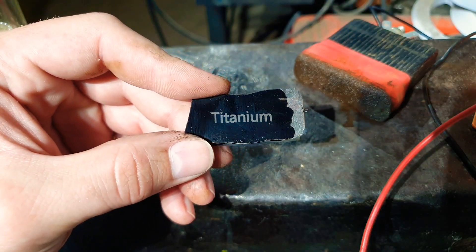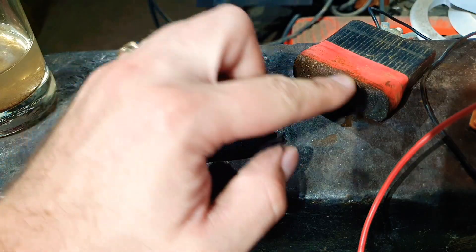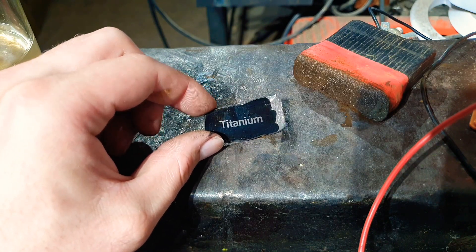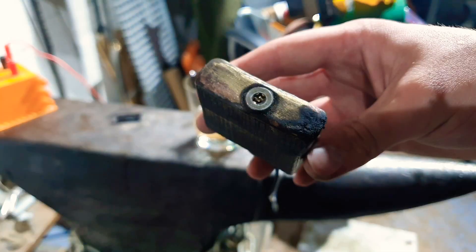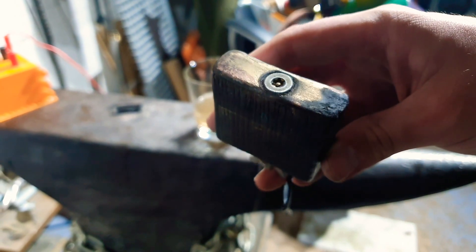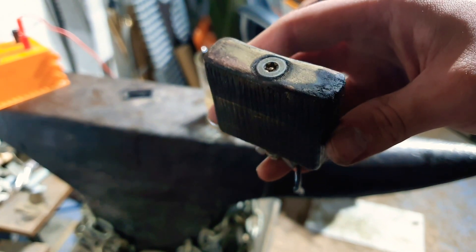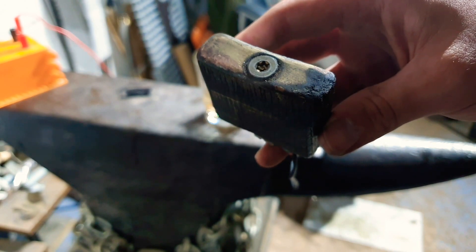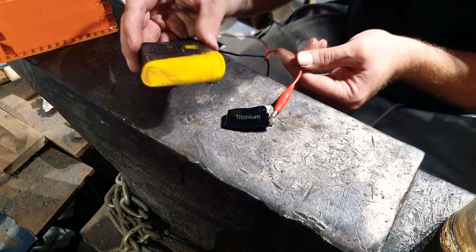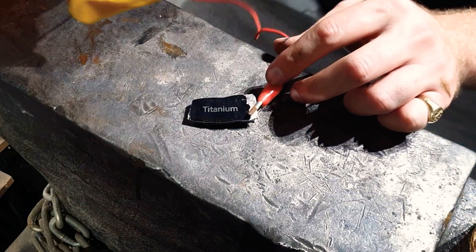Now I'm sure you've been curious to see what happens with the titanium. Having learned from my previous test, I'm going to change out the felt on the applicator to a fresh piece so as not to contaminate this test. Looking at the removed felt from the applicator — the brass piece has got some copper adhered to it as well as bits of molten felt. I'll give it a polish up with sandpaper to get most of the copper off, rewrap it in felt, and we'll go from there. Alright, I've changed the felt out and got some fresh salt water — let's see what happens etching titanium.